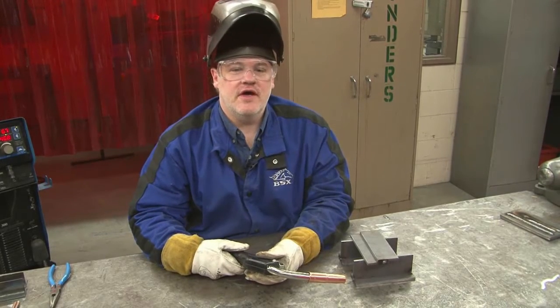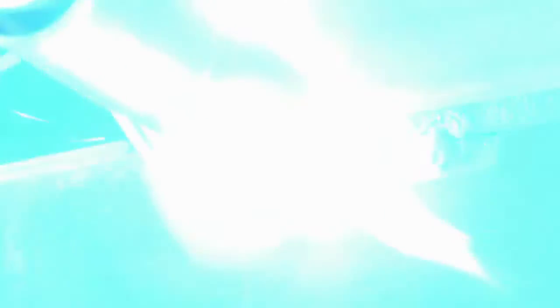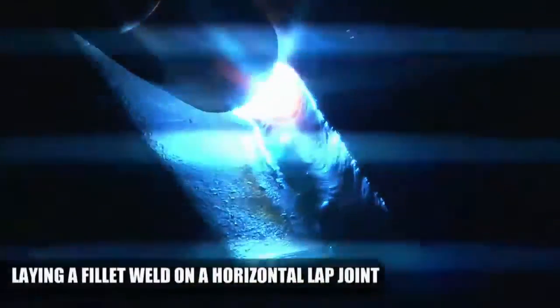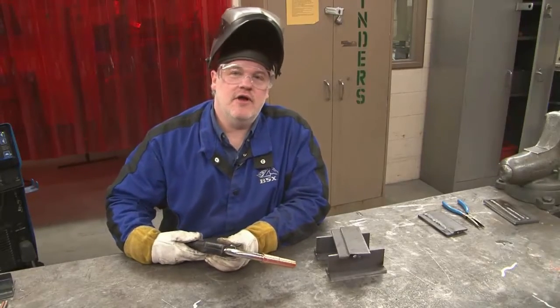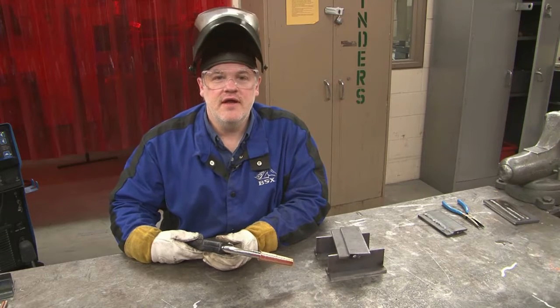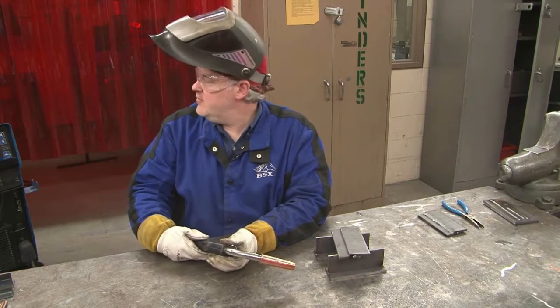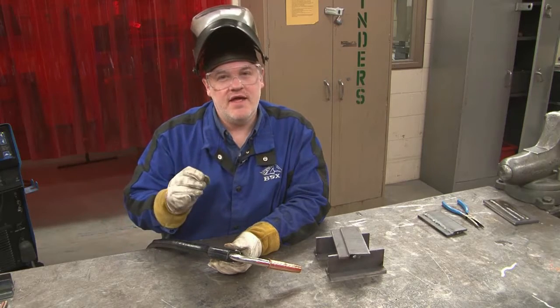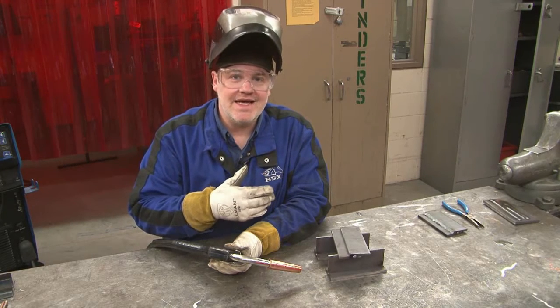Next, we're going to apply a fillet weld to this horizontal lap joint — quarter-inch steel — and we'll make a full-size quarter-inch fillet weld in one pass. That fillet weld was made with a wire feed speed of 450 inches per minute and a heat reference number of 68. We've turned down the wire feed speed to 400 inches per minute and a heat reference number of 57. By lowering the wire feed speed and the heat reference number, we can get a smaller fillet weld in the same joint — now making a fillet weld less than a quarter-inch.